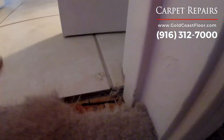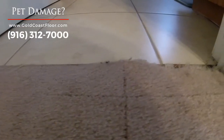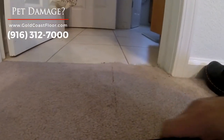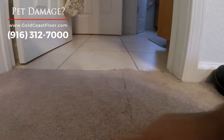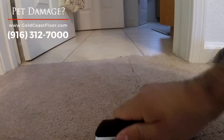I'm also going to give you guys some tips on how to do a flawless carpet repair and have the carpet running in the right direction. The first thing I like to do is mark out the area I'm going to be cutting, and I do that with a Crain 367 residential row finder.